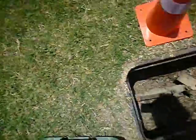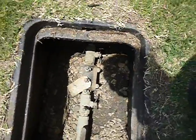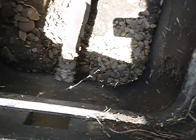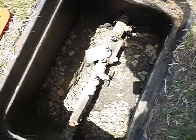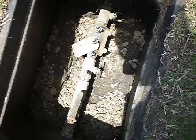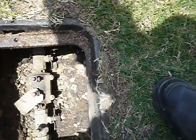Now, outside of the parkway, but close to the meter, which is convenient, this is the check valve for the lawn sprinkler system. The main shut-off valve handle's a little bit rusty right there. It probably hasn't been serviced in the last year, but we do have 3 inches of clearance underneath it, so you can wrap your hand around it to work on it. The floor is lined with gravel.